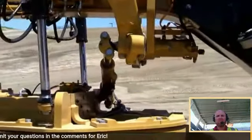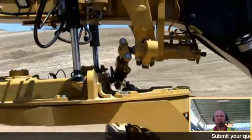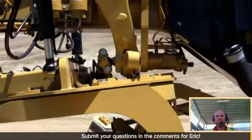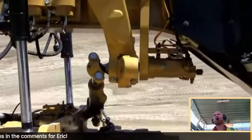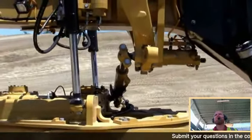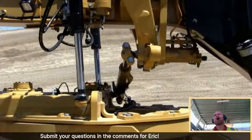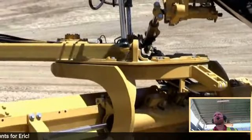With ET, when you set this eFence up, you can set it up how close you want to these different components. So I set it up within an inch to the link bar because there's a lot of times you're working slopes and ditches and different types of things. You want that distance. But I left quite a distance between the edge of the moldboard and the tires just to give us some safety buffer there. But again, it's fully adjustable and you can enable it or disable it.